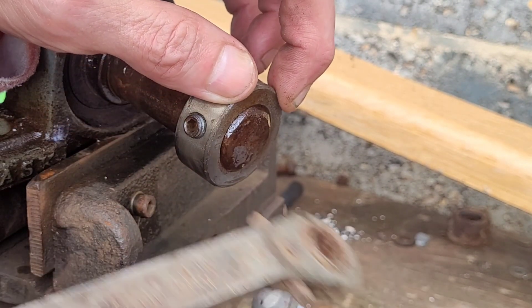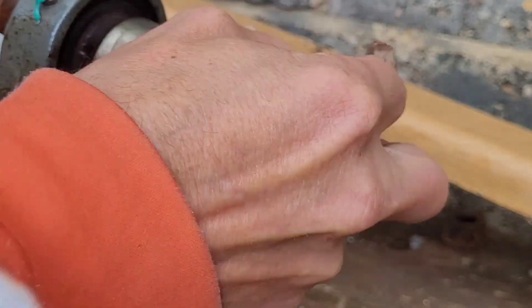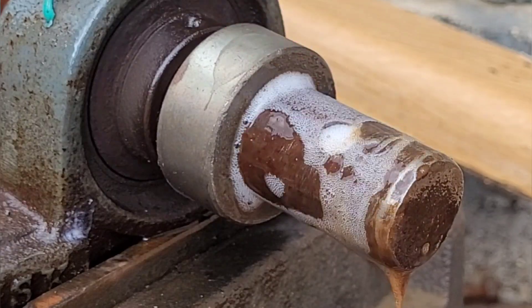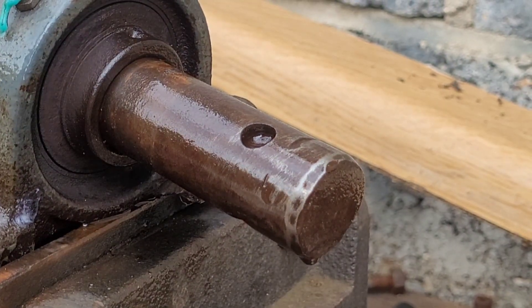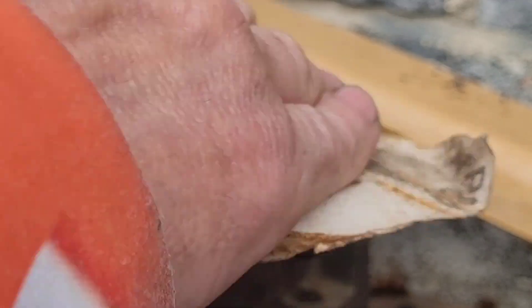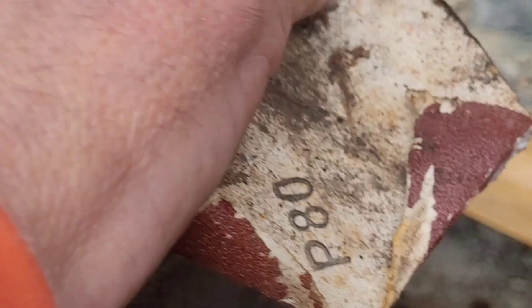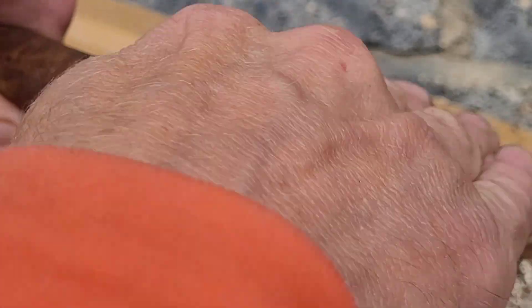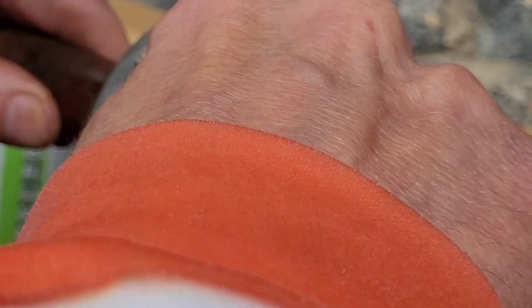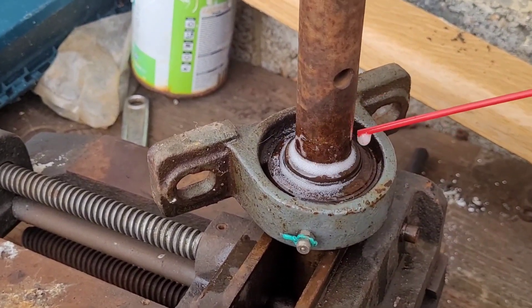To be fair, if you look at that, the end where it's obviously been hit a few times, so I'll need to get some sandpaper just to take care of that. I'm just going to take the excess rust off. A bit more WD-40, and then if we're really lucky it might come off. Just going to put some WD-40 in this hole here which doesn't have a grub screw in. Finally going to squirt some more WD-40 in and then we'll leave that for an hour and come back and start trying to knock the shaft off.